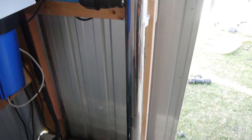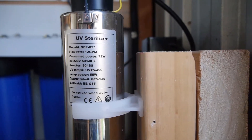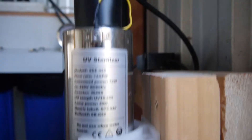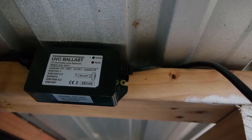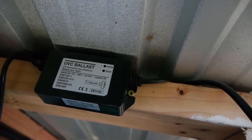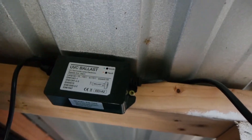Then we've got a UV filter running here, which has a UV lamp in it and does use power. It's a 55 watt unit — there's the flow rate and specs if you're interested. It's connected to what's called a ballast, which has a fault light. If the UV filter breaks or gets too dirty and needs replacing, it'll start beeping to let you know. The lamp is about a year, and the quartz tube on the outside is about three years before you need to replace or clean it.